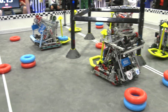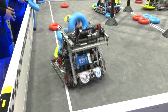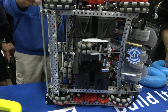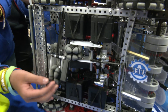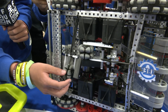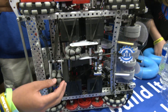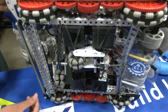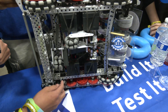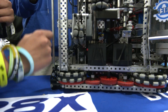Let's pass over to Alex. I noticed you're rocking odometry pods on your robot as well — talk to me about why having odometry was so important. During autonomous it's really important that we know where we are so the robot can turn in the right directions and follow the path. For our odometry wheels we have very small omni wheels and rotational sensors that detect the rotation on the omni wheels. To hold these parts together we have laser-cut plastic parts which are very precisely cut, allowing us to track very consistently. For redundancy we also have an inertial sensor, which makes our autonomous very effective.